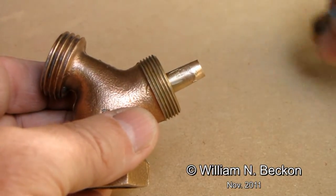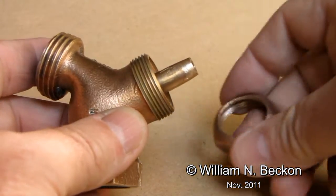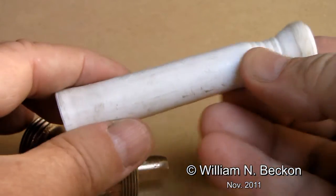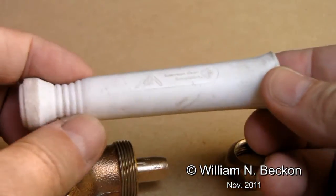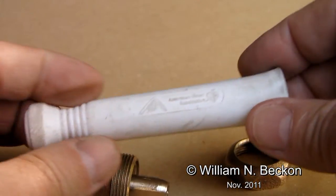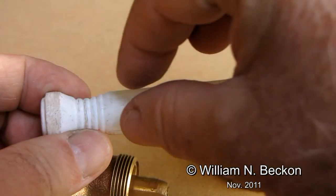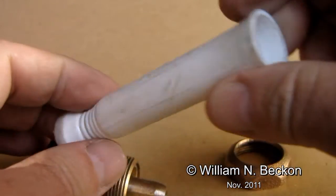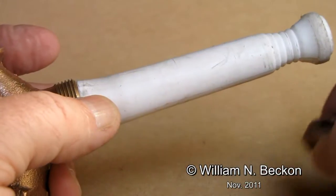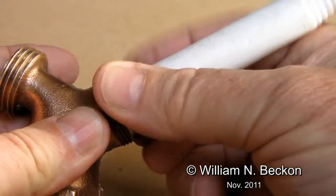The collar that used to be around there is reamed out to serve as a retaining ring around a diffuser. The diffuser is made by slight modification of a piece that was on hand — cut off the end, and the resulting piece is almost perfectly shaped already for a diffuser, with a converging section and a diverging section. A little bit of reaming smooths it out inside and makes it just about perfect for this job. We put that on over the injector or nozzle, put the retaining ring in place, and screw it in.